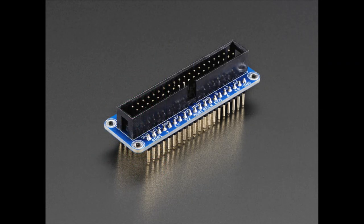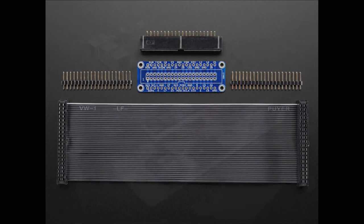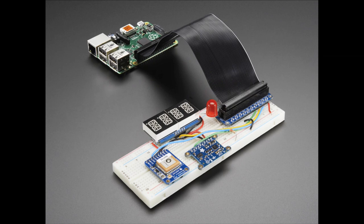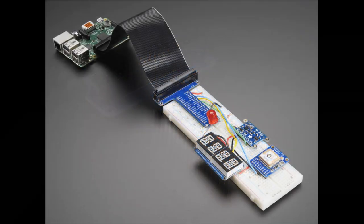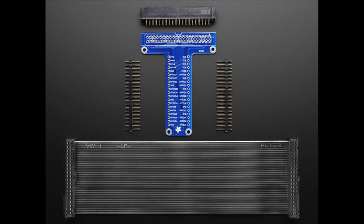Next: cobblers. We have new cobblers — we designed these basically as soon as we found out about the B Plus. We have a prototype PCB and are getting final PCBs in. This is our most popular cobbler — a way to connect a GPIO cable from a Raspberry Pi to a breadboard. It comes as a kit with a gigantic 40-pin cable. We also have it in T cobbler shape, which is slimmer but easier to read. Designed by K-Town. These will be available preassembled but we're starting with kits because we can get those to people faster.